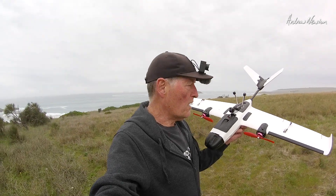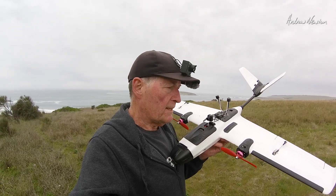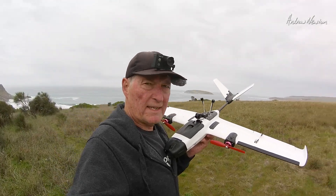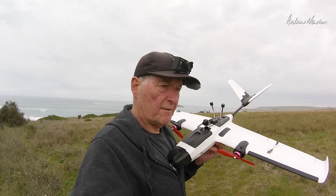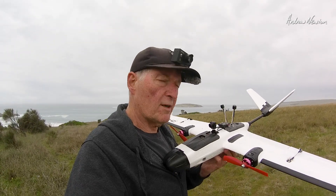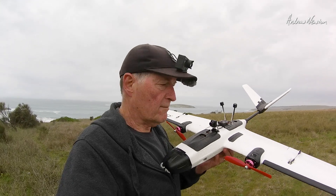Greetings folks. Although I really like the Caddx GM3 3-axis gimbal, it's probably a bit delicate for my style of flying and this flying field here, where I have to sort of bang it down in the tough grass and landing on the dunes and stuff like that. So I've changed the panning setup just to a servo — a 180 degree servo that I've increased the throw so that we can get about 270 degrees almost of travel.